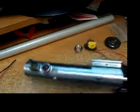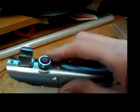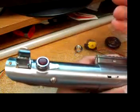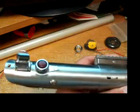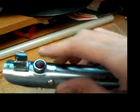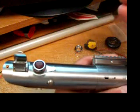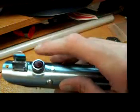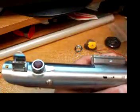First things first, like I had said in the description, this is to activate the lightsaber on and off. Now you can go to — I think it was Grayflex Shop, I had put the link on the listing for it. You can go there, you can get a push button, it's like a click button to replace the switch. It's really easy, two wires, they solder directly on the board. They give instructions on how to do so. All you would do is press it up and down to turn the lightsaber on and off.